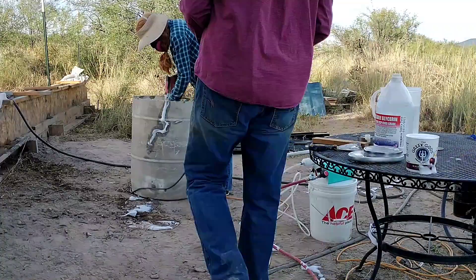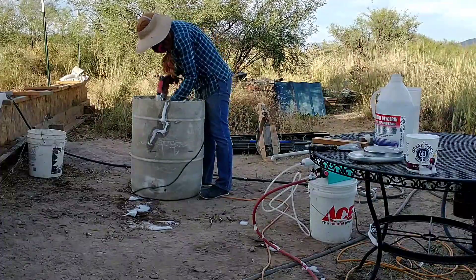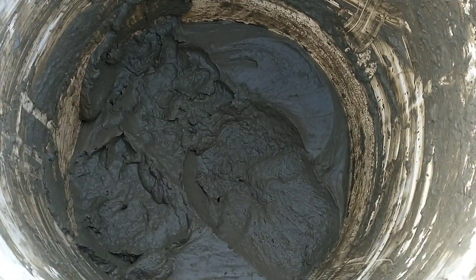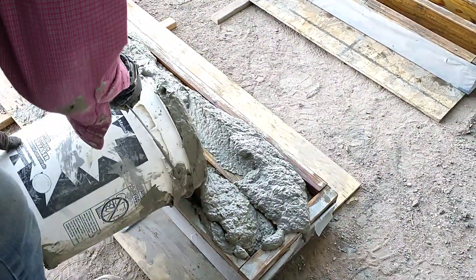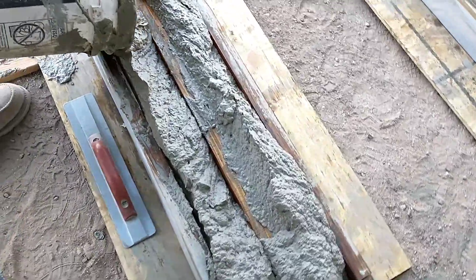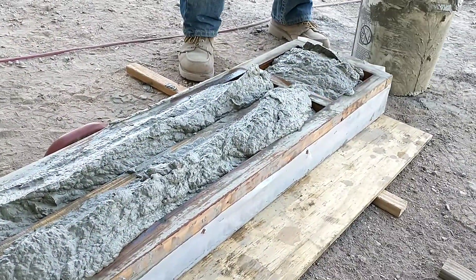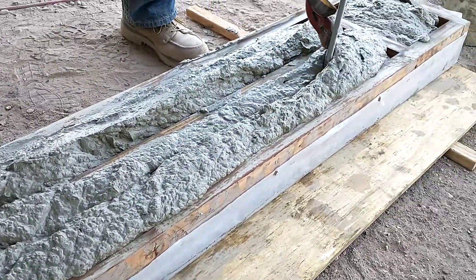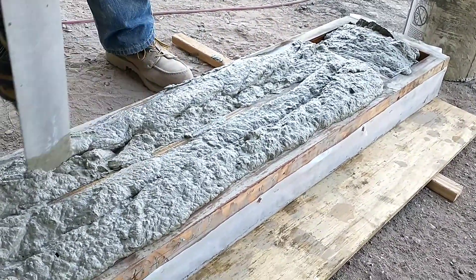There are a lot of different additives you can add to aircrete. We thought about basalt fibers and small metal fibers, among others, but those are quite expensive and significantly increase the cost of each batch. So we ended up focusing on low-cost additives — sand was low cost and this paper fiber was low cost, and the metal reinforcement was pretty affordable too. That's the reason we made the decisions we did on the types of reinforcements to test: a lot of it had to do with cost effectiveness and availability.